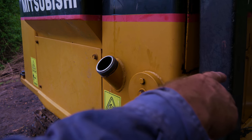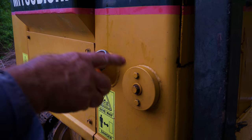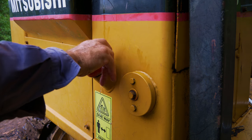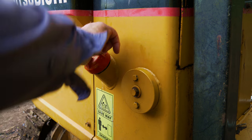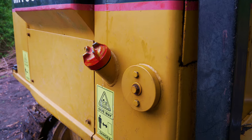So I've added all the hydraulic fluid now and as you can see the level on the side is right up to the mark. Replace the filter and I'm just putting on the top, and I'll give it a run and then check the fluid again in about half an hour.